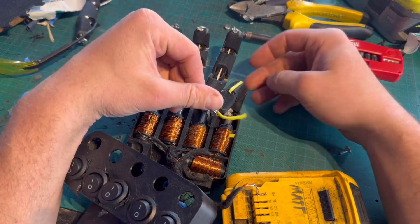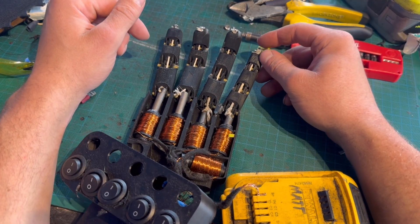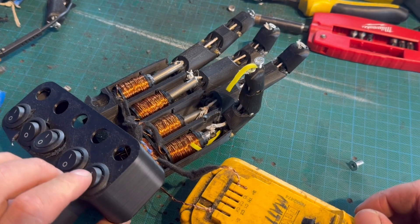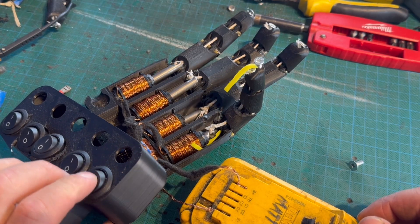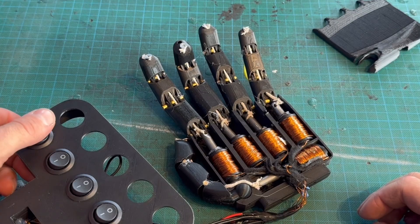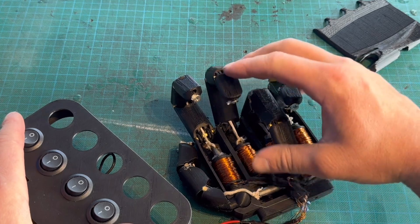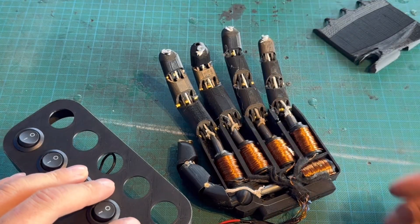I then tried to get the elastic into the fingers, which was much harder than threading the string. It kept sticking in the holes, though I did manage to get it through and pinch it against one of the solenoid collars. However, as I feared, there's just too much drag on the elastic through the holes — it barely springs back. I think I really need to incorporate a small spring mechanism into the actual hinges. When testing all four fingers, some worked better than others, with the ring finger folding over the most. I tried retensioning the string and even trimming the rods to get extra movement, but I think it really comes down to those lengthened coils limiting the full amount of travel.